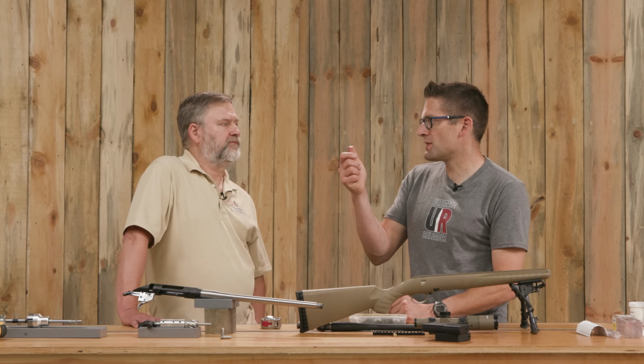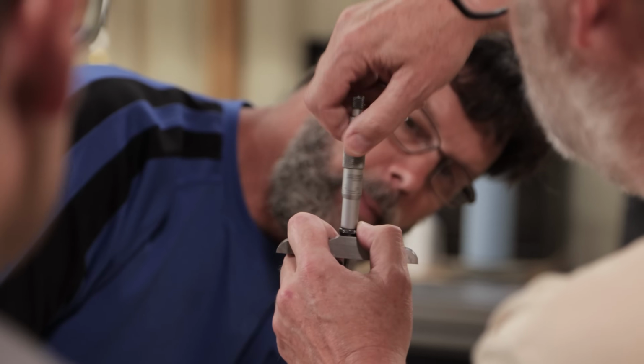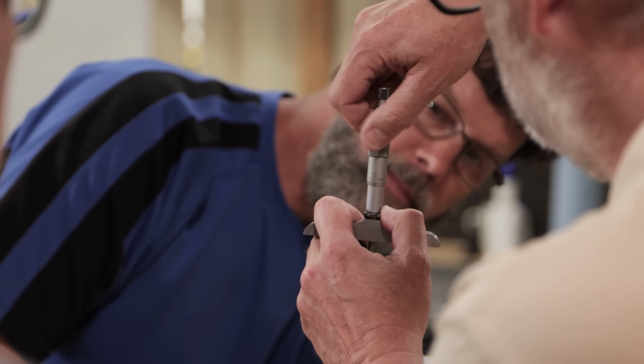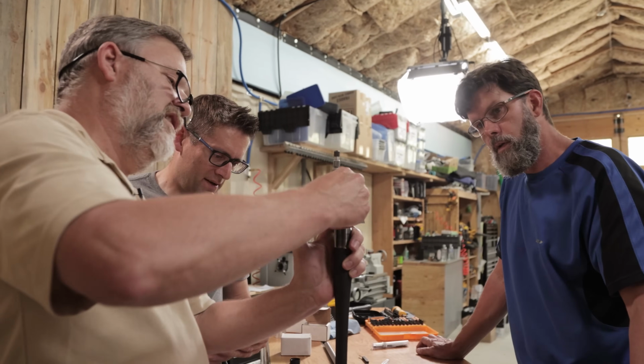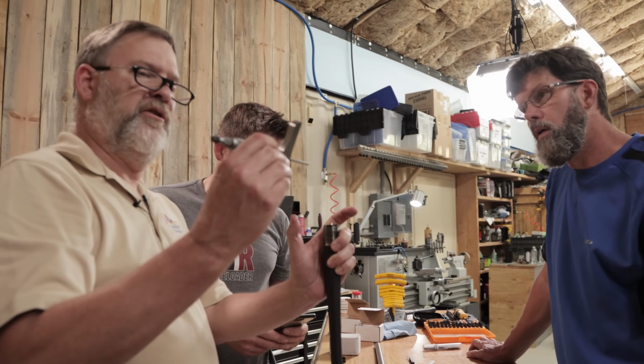Sometimes I like to use two different tools. Like you can use digital calipers to do a depth measurement as just a rough check, right? And then you can use your depth micrometer as the precise check, and then you know you should be in the same range, and then you probably trust your depth micrometer for that really precise measurement.